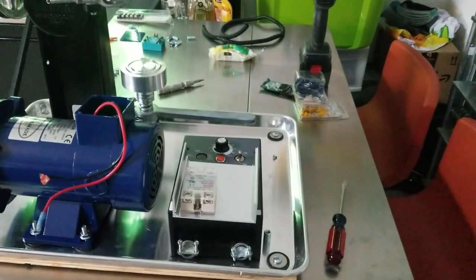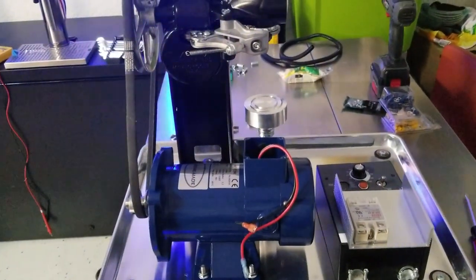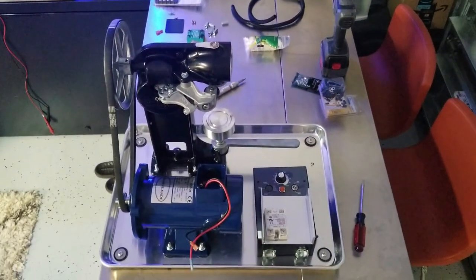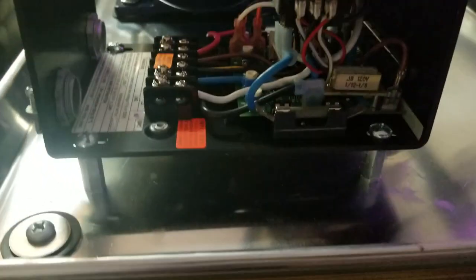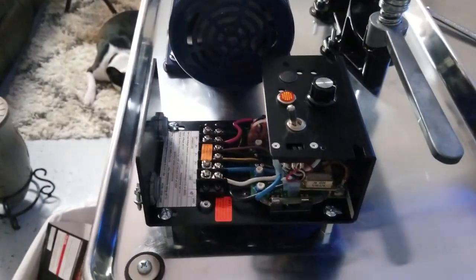Because it's gear-reduced, hopefully I get it to stop properly in the same spot every time. If not, I'll have to use some sort of mechanical braking system. But so far, this is what I am envisioning as the final product. It's still a fairly small footprint, and that's what I was trying to achieve. I have it on the standoffs as mentioned. I also put it on rubber feet just to take any vibrations out of it. It's getting ready for the wiring portion.